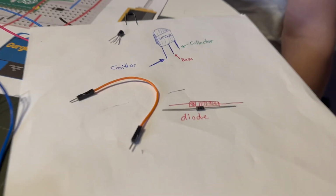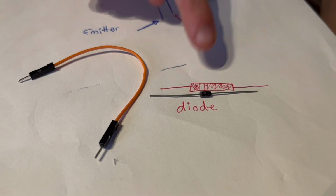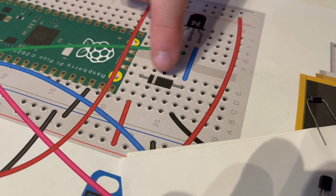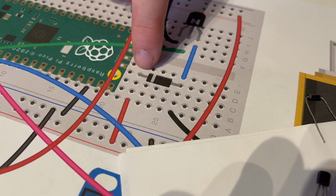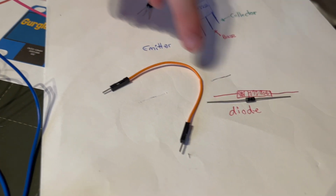You've seen it working without one, but if you want to play it safe, then you can add a flyback diode to deal with the spikes from the solenoid when it's turned off. This end is connected to the negative of the solenoid, and the cathode marked with a white stripe is connected to the positive of the solenoid. So basically in parallel with the solenoid. The diode will probably reach, but we'll use this extra piece of jumper wire like we've done on our diagram.